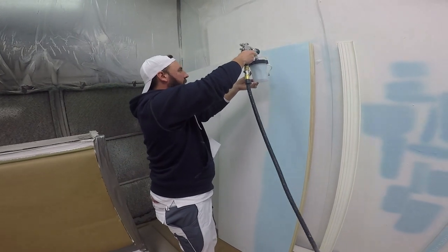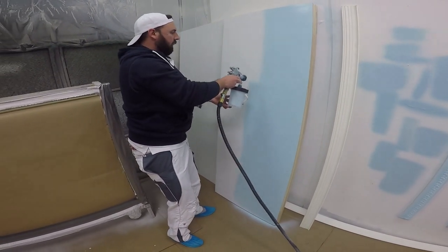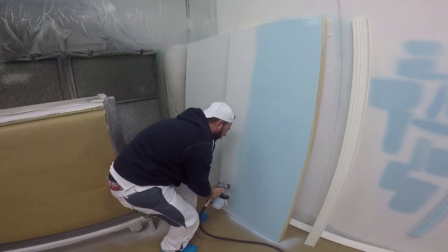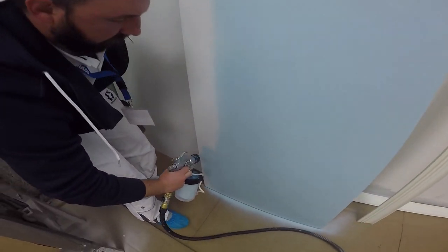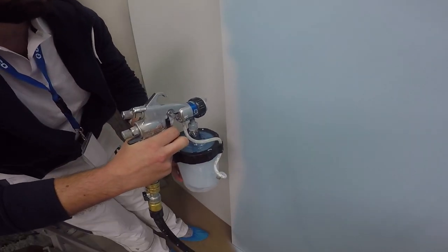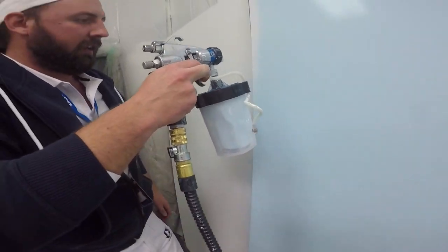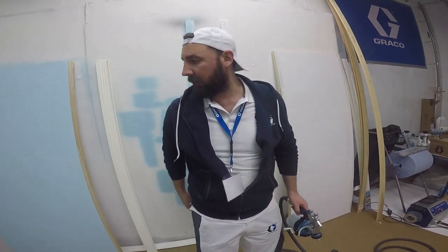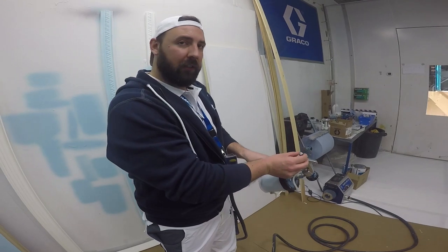This is just a rough demonstration. I always try to have a little less than 50% overlap. I never let go of the air — I will let go of the paint and then start again. But once that's dry, it'll level out quite well. And you can still go quite fast compared to an airless. There is a bit of dust in the air because I've got the air on quite high, so you can reduce the overspray by reducing the air and the fluid.